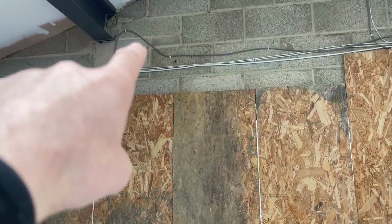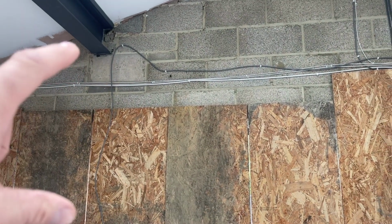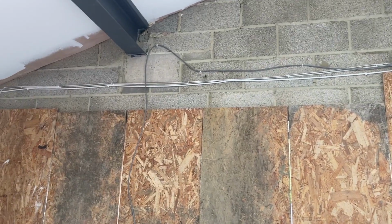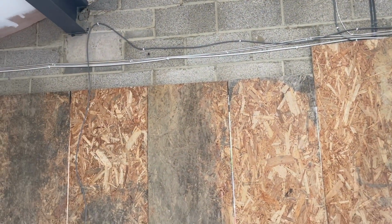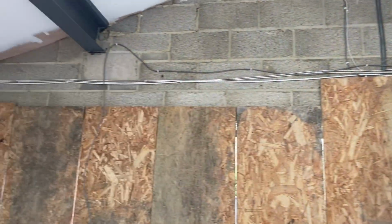is, if you see the white cables there, the steel is 300, the bottom plate's 8mm, so 308, so it's probably halfway on that pad stone there. So I'm going to prop the third course up, and then that will mean I don't have to prop that steel up there because it's propped on that wall, and I just have to prop that steel and the other one over there that you can just see, and then lose them bottom two courses.